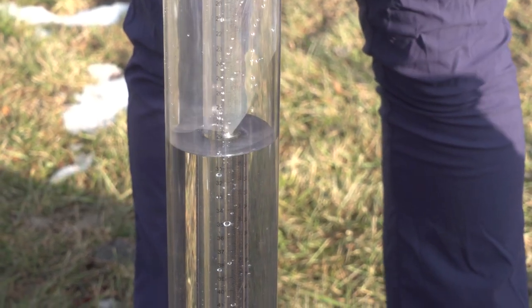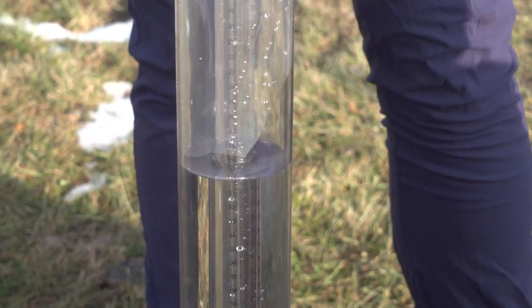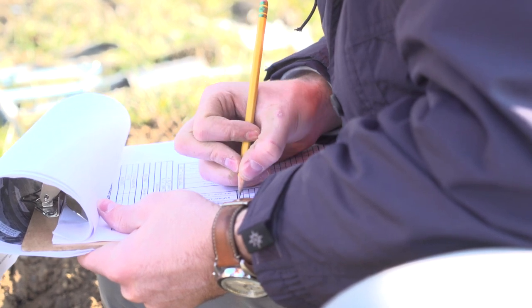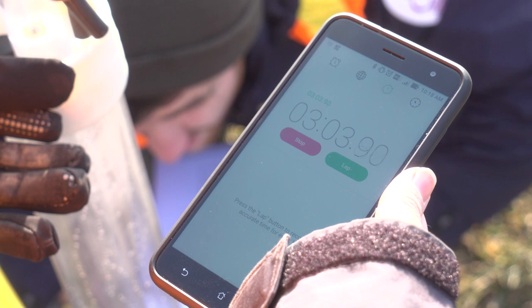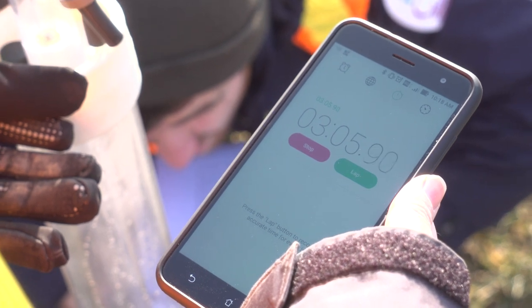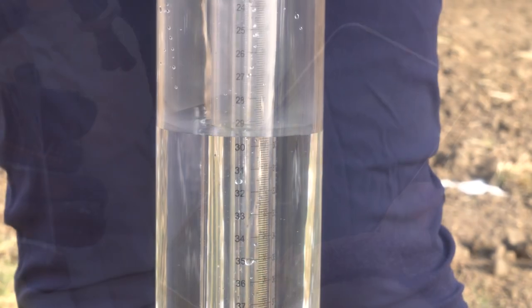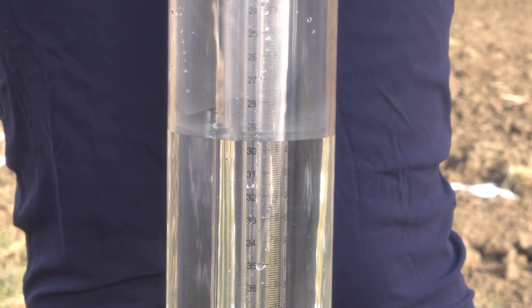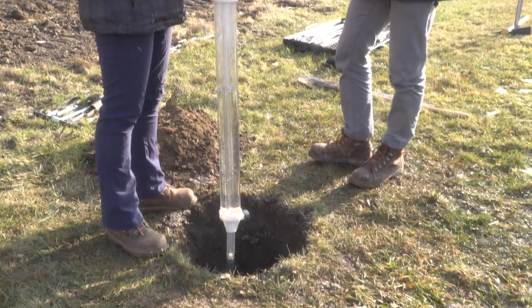This value represents the constant head of water that is applied to the borehole. Take note of the value that you apply — use a larger head if your soils are of low permeability. Have a stopwatch handy and begin timing as soon as you begin to pull upwards on the upper air tube. Note the elevation in the reservoir as indicated on the scale; this value will continue to drop as water leaves the reservoir and infiltrates through the base of the borehole.